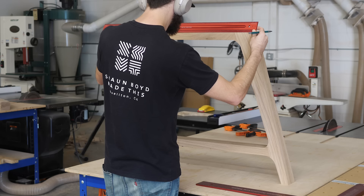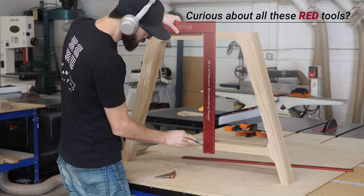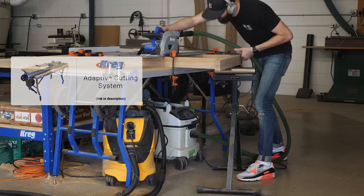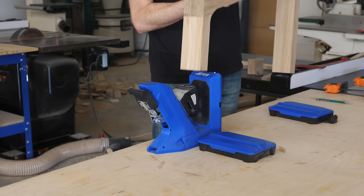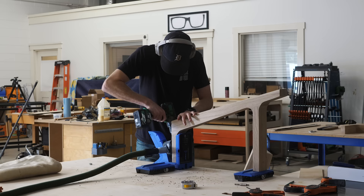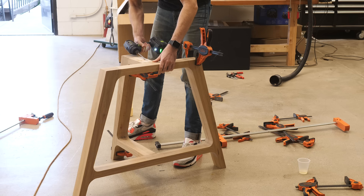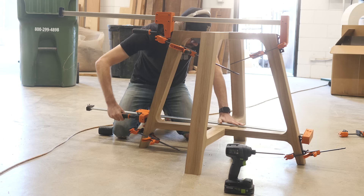At this point we've got our two leg sub-assemblies that we need to turn into one base. I decided the easiest way was to mark the thickness of one sub-assembly on the center of the other, remove that material, and glue the entire thing back together. To put everything together I actually used two methods — I wanted to illustrate the options for the plans. One leg I attached with pocket hole screws, which will be essentially invisible since the pocket holes on top get concealed by the tabletop and the ones on the bottom are on the underside of the stretcher, only about five inches off the ground. For the other, I used some dominoes — though dowels or any other floating tenon joinery system could be substituted.